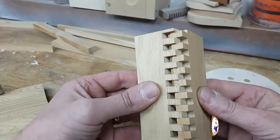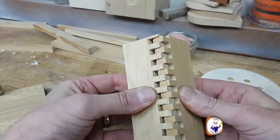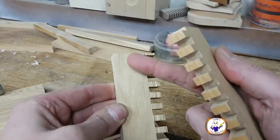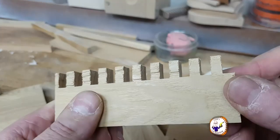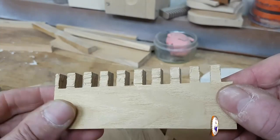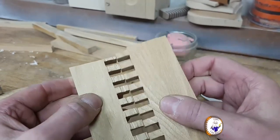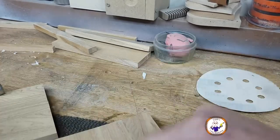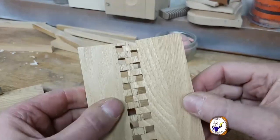I've done my little trial run here. Now it's a little bit tight — which is funny because with the MDF it was a little bit loose. It fits okay but the problem is where I've cut this, I've cut it across the grain. The grain goes this way and I've cut across it, and what it's done is given us loads of little bits of chip-out where the wood has come off. When you put it together it ends up with quite a nasty little joint. But I think it's okay — when I do this box I'll be cutting it on the end grain so I'm hoping it's going to be a bit cleaner than this.